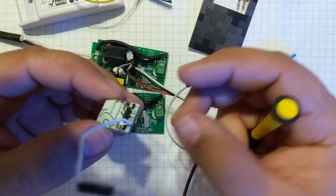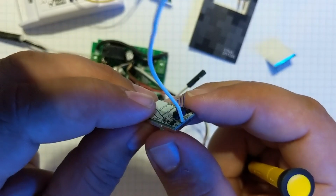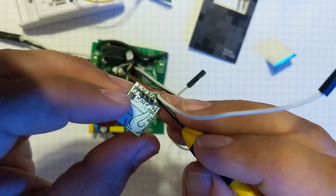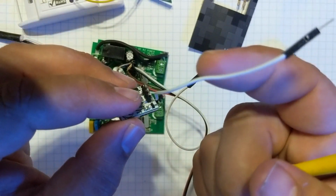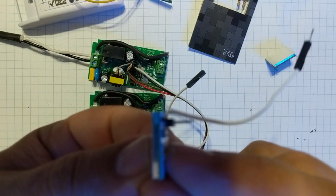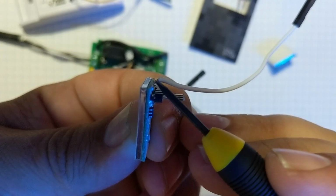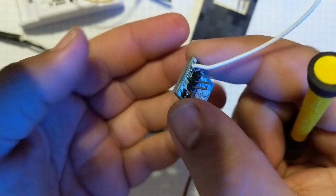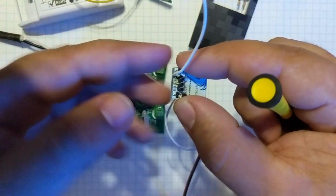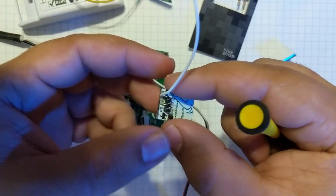It's essentially the install is the same, but so back to this. The best way that I found to do this is essentially take a wire and solder it directly to the pad. What this does is it allows some flex in the wire and stuff, and it won't rip the pad off. And you can see, if you look at the side, that I actually purposely soldered it so that it hung off the pad and 90'd up. So what's going to happen is when I hot glue this down to my faceplate, my blank switch plate, I'm going to actually run a little bit extra hot glue around here and give this sort of a relief so that it doesn't break off.